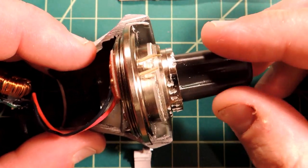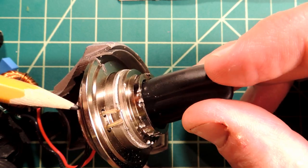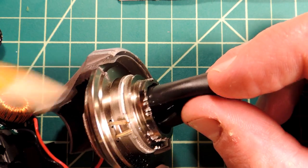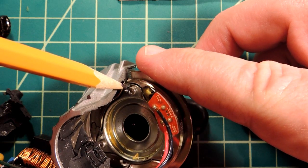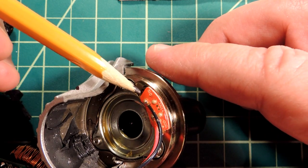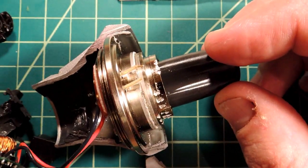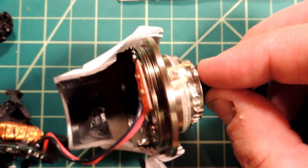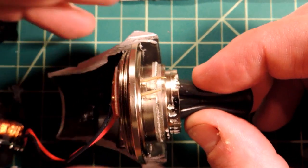Taking a closer look at this piece: there's the bladder, a casting, and what appears to be a machined part with machined screw threads. There's a retainer ring clip, and the bladder itself is held on by a piece of stamped metal with three pentalobe screws. There's also a circuit board here as an intermediate carrier, which appears to have a conformal coat to keep liquid from running into the electronics. What this all means is a lot of manufacturing steps and a lot of parts — it's hard to imagine building anything cost-effective continuing to use so many components in what is essentially a disposable consumer item.